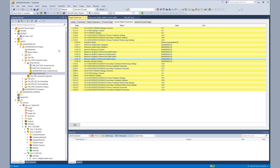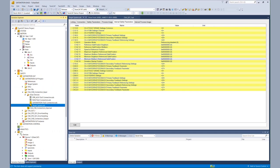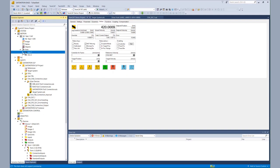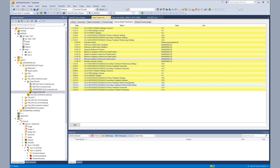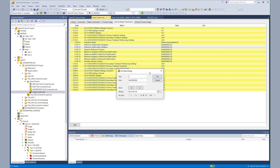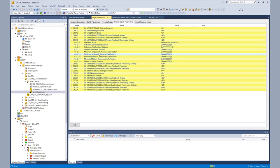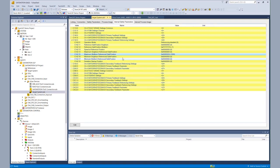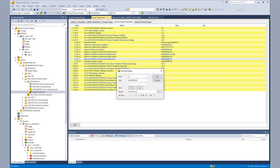In today's tutorial, we are regarding the multi-turn position. So we need some information from the NC for the reference safe position. The drive is currently standing at 420 millimeters. To have that as the zero value within our safety project, we need to configure the reference safe position multi-turn. The drive is configured for 60 millimeters per rotation, so we have to input 420 divided by 60, which is 7, or to give it the offset, minus 7. Last but not least, we input the maximum and minimum multi-turn configuration — in our case we choose 1000 and minus 1000.